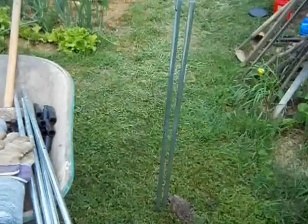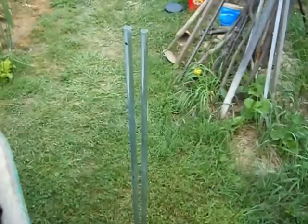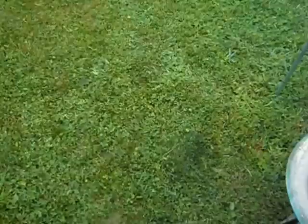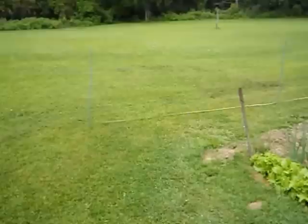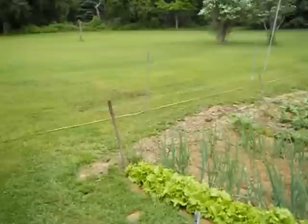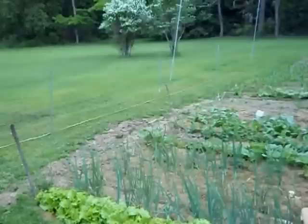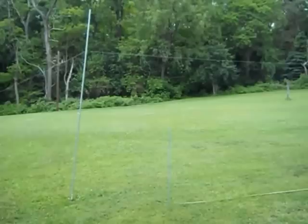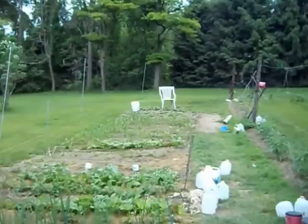We made 15 posts. This one's going to be my gate — I already test drove the wheelbarrow through it. The closest post to the left will be removable, as they all will; I'll put a plug in the ground over there to set it aside. It'll pivot off this post, run to the corner, and that left us eight posts — four up the side every 10 feet — giving two corners and four in the middle for a 50-foot run. When I did my deer fence on the opposite side, I didn't measure anything or use a straight line, and I could have saved myself twenty dollars on an extra roll of deer netting if I'd measured before I started.